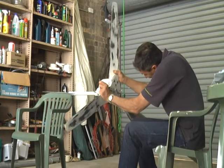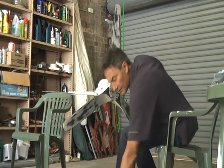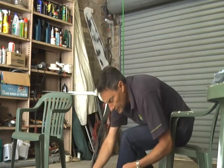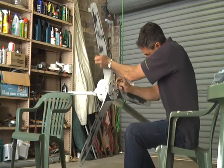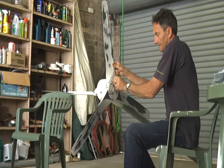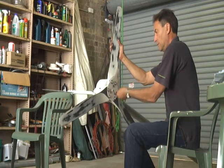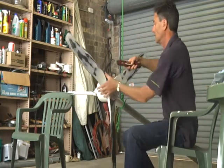You're going to need a 14mm or 9/16 socket. Tighten that up finger-tight, then put a bit of grease on the other two bolts — just a little bit. Now what we need to do is tighten all the bolts just finger-tight so that the blades are held in place but can still be moved. We double-check the level.